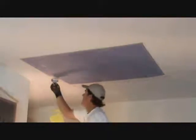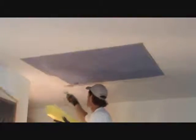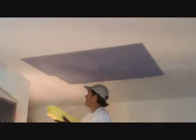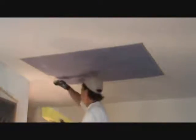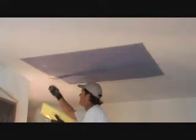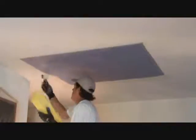I had one little bit that already fell down on the floor — that's okay, that's why I got plastic down there. Even though I'm going to put another coat on here, you still want to get this up so you don't have too many high ridges on it. Because the more buildup you have, the wider the patch you're going to have to make later, or else you're going to see a bulge in your ceiling.